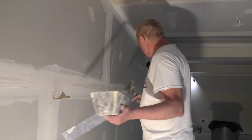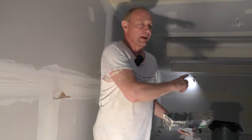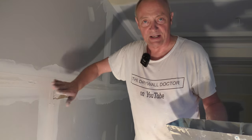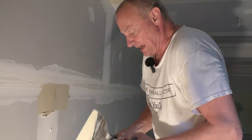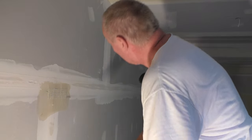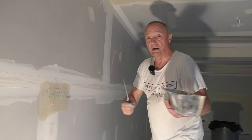As I was getting set up to show you me boxing this, I saw a bad spot here on the wall. I've had three of them in here — I spotted two when I was pre-filling and fixed those, but this one I didn't spot until just now. I heard it because it had a hollow point. So I have to fix this first before I can box this. I have some fiber fuse — some super strong fiber fuse — so I'm going to put this in here first, then I'm going to show you how I box this wall, how I cross up these butt joints, and what I do with these angles.